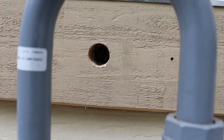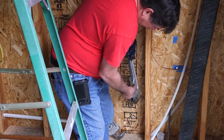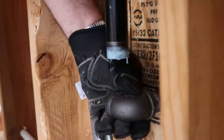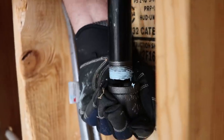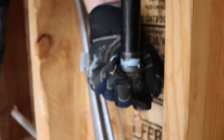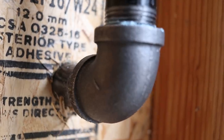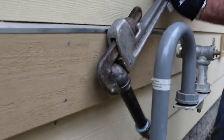This is the last plumbing video you're going to see for a while, and it's for the natural gas lines. The cooktop, the water heater, and the dryer are all going to use natural gas. Phil is running the gas to these locations with what is known as black iron pipe — this just means it's made out of mild steel and it is not galvanized. This material is a lot less friendly to install than the PVC or PEX that you saw for the drains and the water. The threads are cut right into the steel pipe and then they thread right into the steel fittings. Pipe threads are tapered — they get tighter and tighter the farther in they're turned. This technology has been around for a long time and it's still a great way to do this sort of thing.